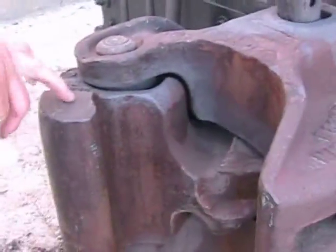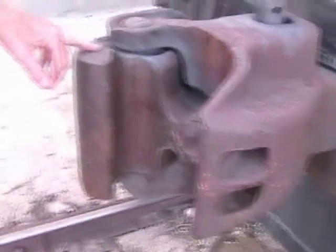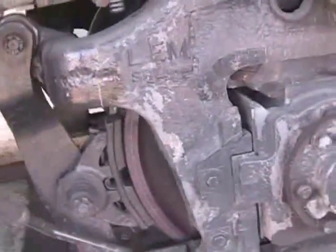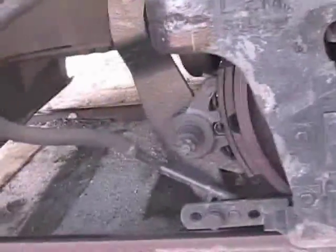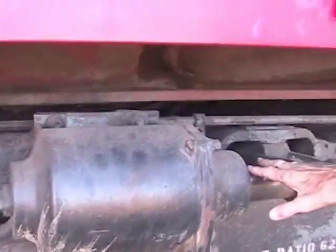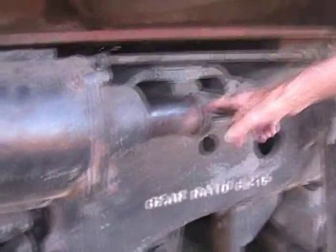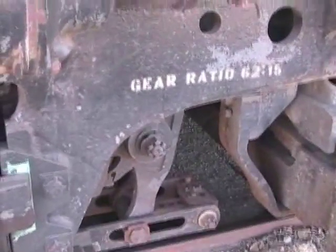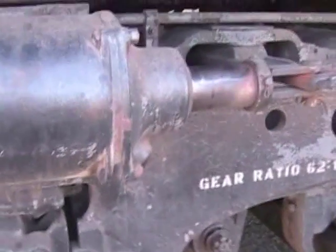There's a hole in here so you can look inside this coupler knuckle. You can look at the brake shoes, make sure they're not going down too thin. The cylinders are allowed 6 inches when you put the brakes on — that's fine. It's at about 4 or 5 inches.